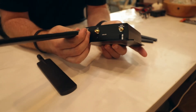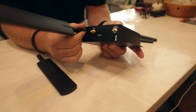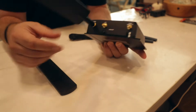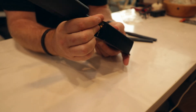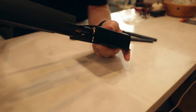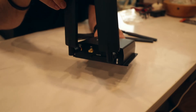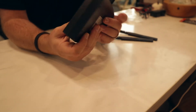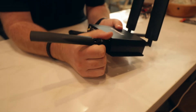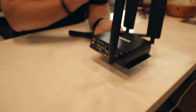The big fat antennas go on the cell phone side. Screw them in gently — push until they stop turning and make sure they're snug, but don't go any further. Do the same for the other side: snug and tight. Then fold the antennas up so they face over the front of the logo, since you're going to mount the unit on the other side. Now for the two Wi-Fi antennas, A and B — again, snug and tight, and face them upwards.